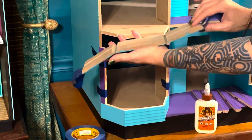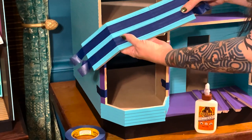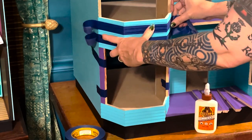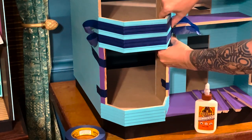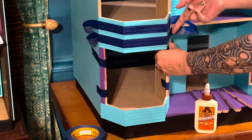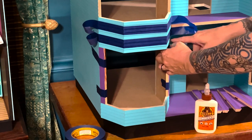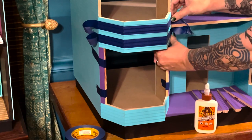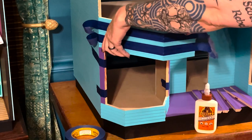They're the same top or bottom. So we need to make sure that we have our siding going down, and we'll dry fit this in again, make sure everything looks good and it's going to fit in with these just fine, and it does. Of course, we'll have to push that a little bit more, because you're going to want to make sure that it's one continuous piece here. It's going to go in a little bit just because you've got the siding coming out at a bit of an angle, but you want to make sure it's one continuous piece and that you're flush on the inside with both of these pieces and all that. So it's fitting really good.